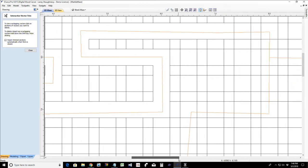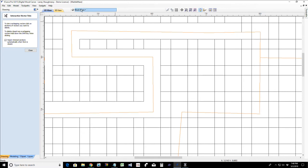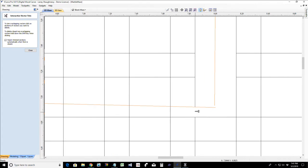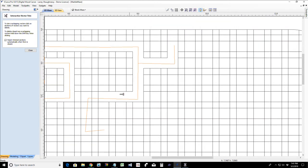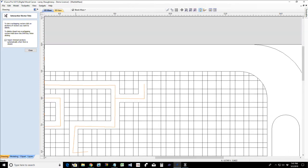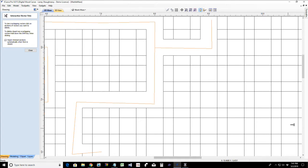Now I'm back to trimming everything making contact with my polyline, and the correct layer is active so nothing will turn orange. We're coming around the corner for the false trail and getting it trimmed away. Don't accidentally trim your polyline — use Control-Z to undo. It doesn't matter if the line is crooked; this just gives us a line showing where we need to trim. We're just creating a path, so it doesn't matter if it goes up and down.